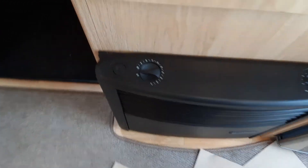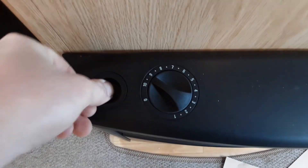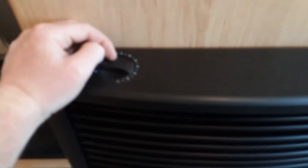Once that's set, you can come to the gas options on top of the heater. To operate the gas heater, spin the dial on the top left to between 9 and 10, hold down the gas valve, and hit the igniter at the same time. While holding the gas valve down, you'll eventually see a pilot light appear in the window at the front. Once the pilot light is lit and running, slowly release the gas valve after 5 to 10 seconds, then control the temperature on the dial on top.